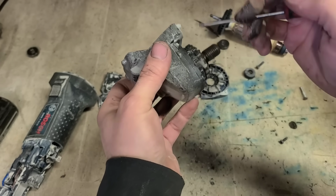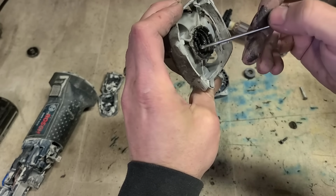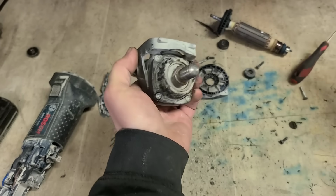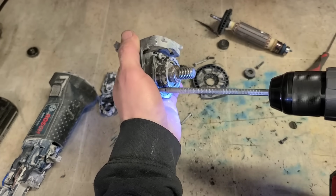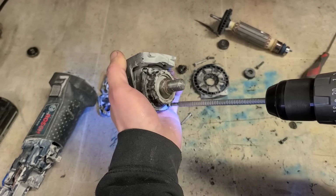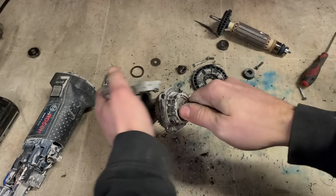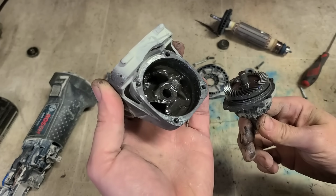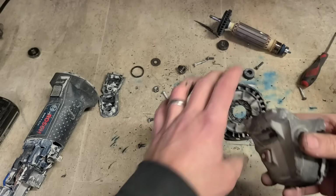And I think this could be looking the same way. Too light a grease. And it looks like hammer grease or something. And just wash this out as well and put in fresh gear grease. Just in case it's doing the same thing and actually leaking because of that. Yeah. That looks a little bit too light. Wash this all down.